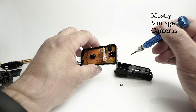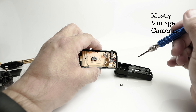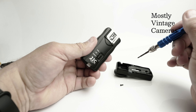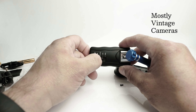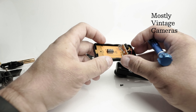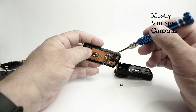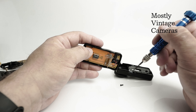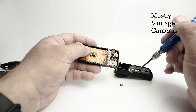Not much to see here — a little microcontroller, DIP switches as before. There is a switch that switches from camera to flash operation, and I would assume that is simply rerouting the signal to the connector for the camera remote or the flash terminal for flash operation.